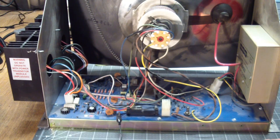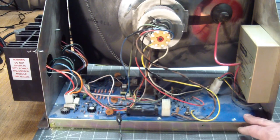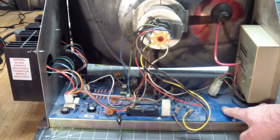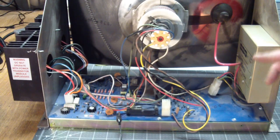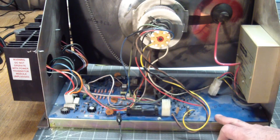And after a lot of searching, I pulled a more recent Cinematronics game, I think it was Star Castle, and the changes are that the original schematic showed the flyback transformer and associated components over here. And if you can see, there's still holes in the board where they were originally mounted, I guess. But at a later time, they came up with an encapsulated high voltage module, which is just plugged into the main board over here. And some other minor changes. There were different voltage regulators in the original schematic. This one seemed to be somewhat simplified.